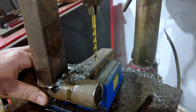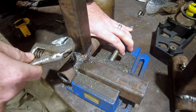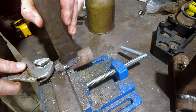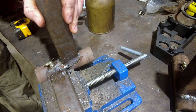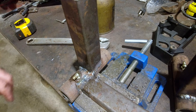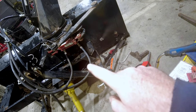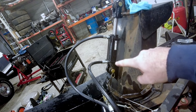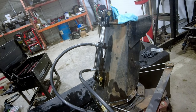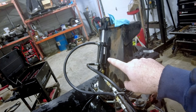So that's how I'm going to grease the spindle — I wanted to get that on there before I welded it to the snowblower. I'm at the point where I can weld this spindle onto the machine. I got it cleaned up, and I also wanted to point something out: somebody left a comment that you can take these cylinders apart and rotate them. I didn't know that, but I tried it out, and now you can see the hoses are coming off the back, which works way better. I still did purchase some 45s to try on there, but I think I'm going to run it like this first to see how that works.